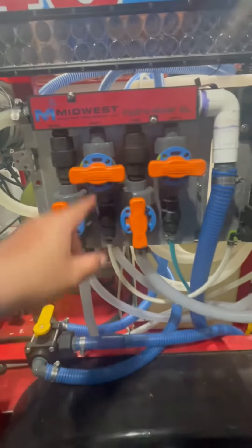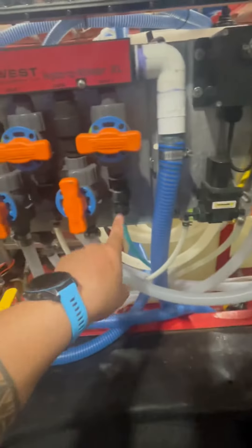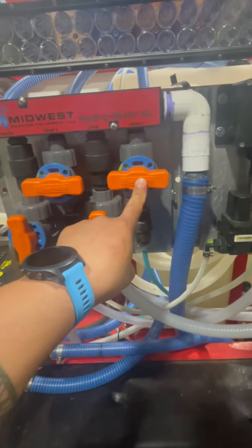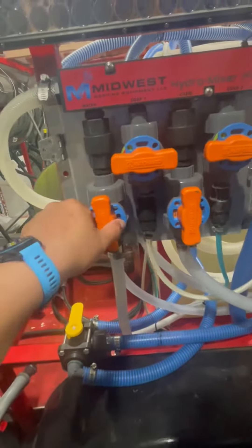As you can see here, that's my rinse line. Now it's critical — whenever I'm rinsing, I block the soap in, keep the can valve wide open so I can flush that line, and then I'll line up my bleach neutralizer so I can neutralize whatever's in those lines and my hose.